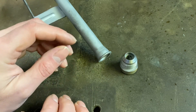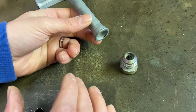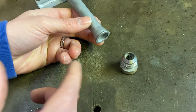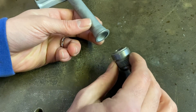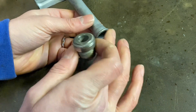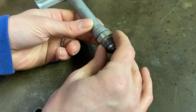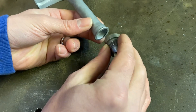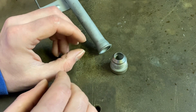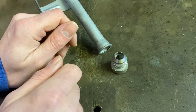This job kind of lends itself to silver soldering because it's inherently strong - it's almost as strong as a fairly average steel weld, depending on what blend of silver solder you've got. The strategy is to machine that off, make it nice and flat, give it a rub up with some emery, drop it on there, a quick dollar of silver solder and it's stuck permanently. Give that a clean, give that a quick machine, bit of flux, bit of heat - silver solder, job's good.